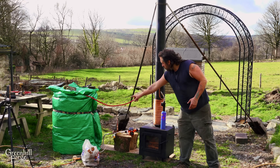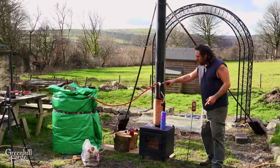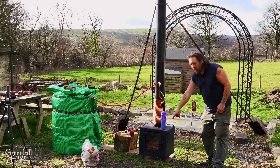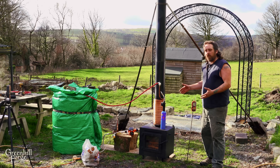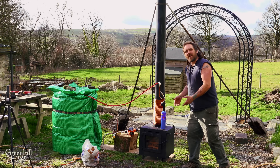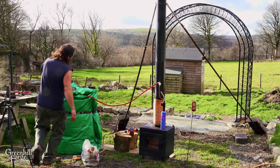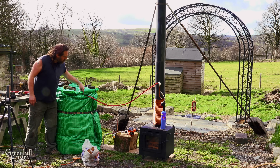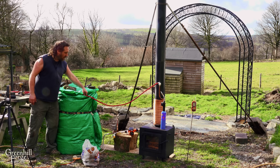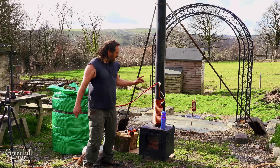There's a pump pushing the water through from the bottom to the top. I'm intentionally not using counterflow, which is more efficient and would push the water down, but eventually I want to take the system fully off-grid so it would rely exclusively on a thermosiphon — so I want to do all the testing with the water flowing in that same direction. Then the water comes back to the barrel that is insulated, and I've got thermometers to take temperature readings of the water in the barrel and of the water coming out of the hose.